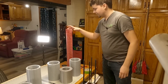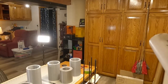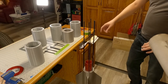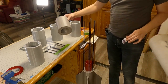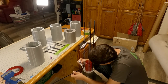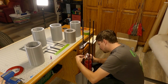For this part I want to go ahead and put in my fiberglass tube. I don't want to accidentally glue this in, so I need to be careful. I just dropped the fiberglass tube in here, and we're going to be using super glue. Initially I'm going to glue all the carbon fiber rods into their respective holes, then put glue around the face here, then glue on the first section, which is just the extension of the fin can going up. All we're doing is coming around and spreading that glue.